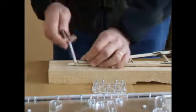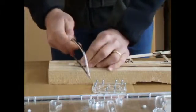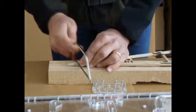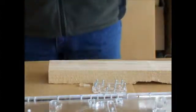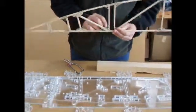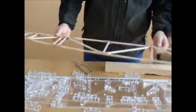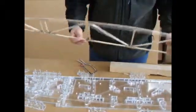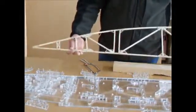The last part of the operation is cutting the excess off the back of the wing rib, taking the saw and lining it up with the WR8. Now you need to inspect the wing rib to make sure that all the glue joints are secure, that all the timber used is of good quality, and that you are satisfied with the overall quality of the wing rib.